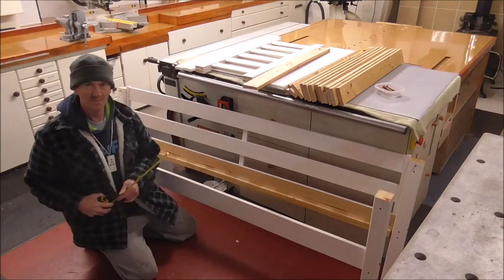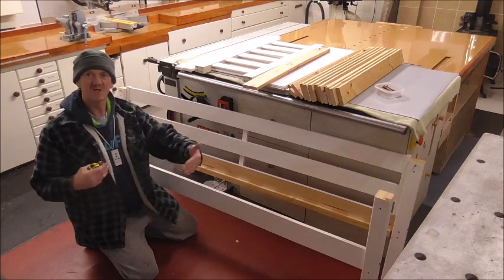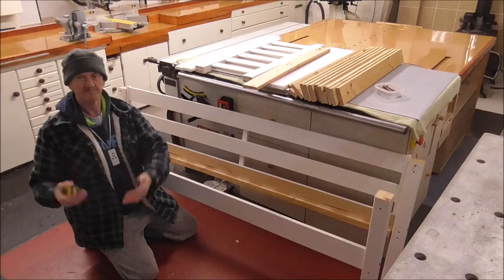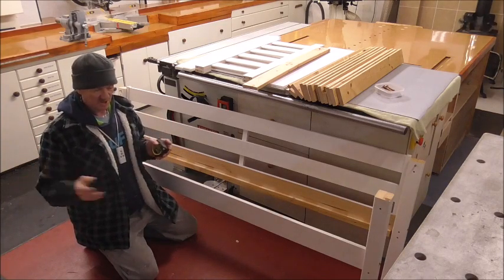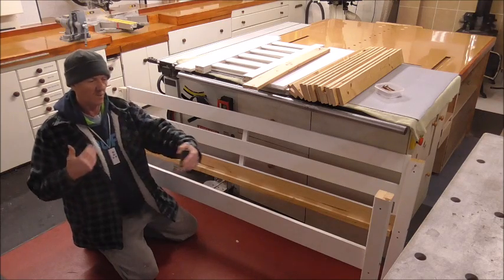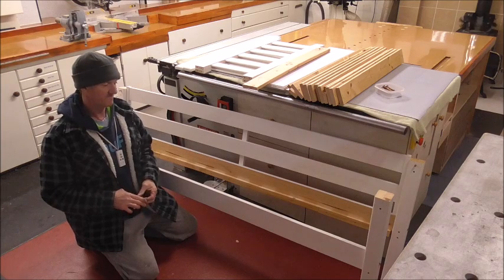The length of the room, we've got the measurement of that. The length of the bed from the length of the room will determine the size of the shelving unit at the end of the bed. The depth of that, because of the layout of the room, will be 430mm. The width, I'm thinking, is going to be not much short of 600 in length.